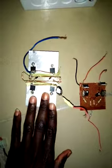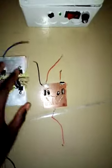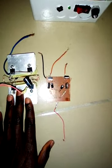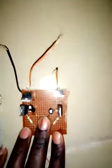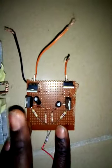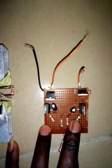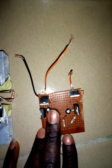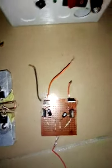I'm now moving on to using the flip-flop circuit, which is this one here. This one has more efficiency compared to the previous one. If you look at it clearly, these are the transistors, the resistors for determining the switching, and these are the capacitors that take care of the timing of when to switch.